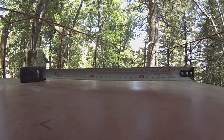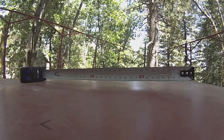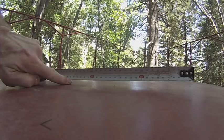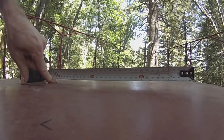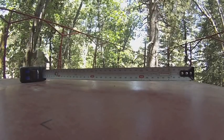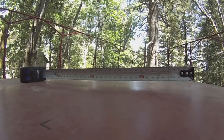Here's a hole I drilled, which is the point at which I hung the plumb bob to place the step for the mast. According to a document I found online about wooden unstayed masts used for junk rigs, 250 millimeters is plenty strong enough. So I'm going to make my hole 300 millimeters in diameter. I'm also going to make it square, just in case I decide to go with a square mast — right now I'm planning on circular, but this gives me the option for later.